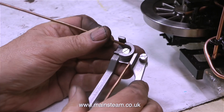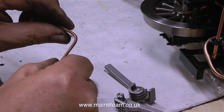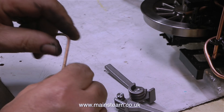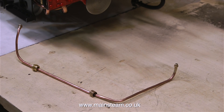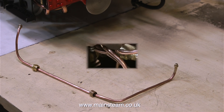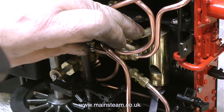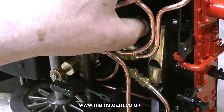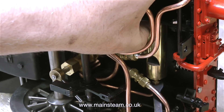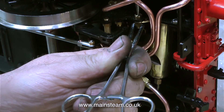Now it's time to fit the whistle. I used the original Chinese piping for this because at one end is a special fitting — a totally different union to the type we use in England, and the whistle has been made to accept this union. So I kept the Chinese union on one end, and once I cut the pipe to the right length and bent it to shape, I silver-soldered on a standard English cone to fit the whistle valve. This part of the job required a lot of patience — it was very, very difficult. I lost the will to live about three times, but in the end it all fitted together, so it was no big deal really.